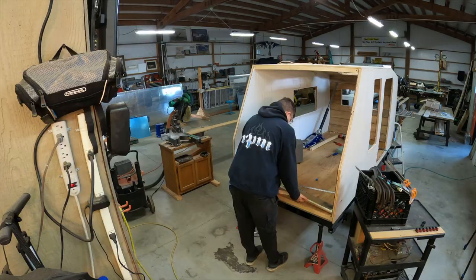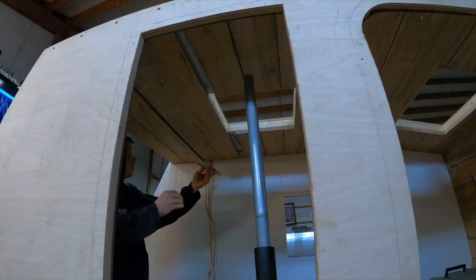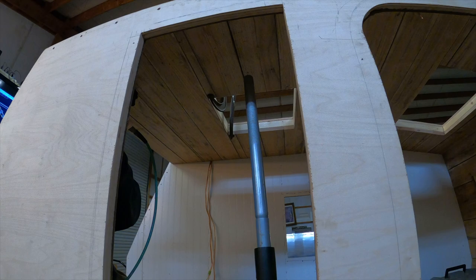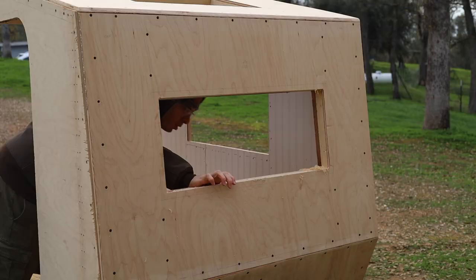To finish out the ceiling, I installed the rearmost board with a chamfer on the edge. I did have to install some more custom width pieces in a couple spots to take up gaps from warped boards, but they're not that noticeable. The last piece was a pretty thin sliver of a piece that I made sure to install where the cabinets will be so that it won't be seen. Even with these small issues, I'm pretty happy with this install. The whole interior looks really good, and we're trying to decide if we even want to paint it. Even with all the screws and splits left in it, it looks pretty good. And the last thing I needed to do was trim all the edges flush using the router.